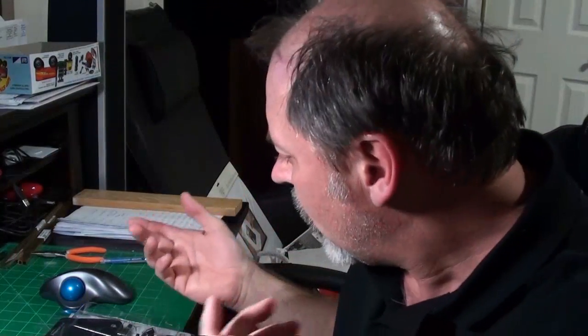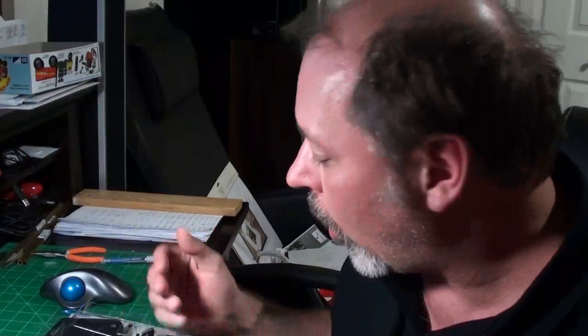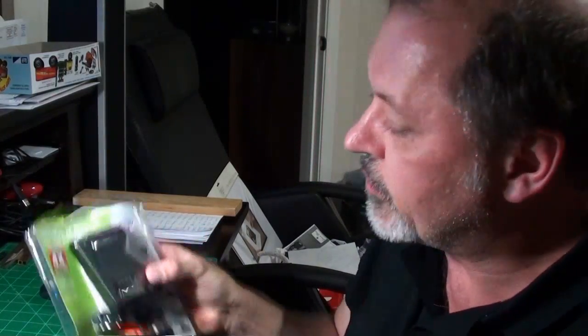Anyhow, we're here talking about Mercury 9. Now, before I can do anything with lighting, I have to figure out the power supply. I have to know what voltage, because the voltage determines the resistors on the LEDs. Okay? And I went to Walmart looking for a power supply, and that was a mistake, and I'm about to explain why.